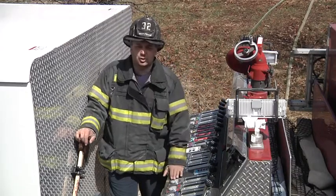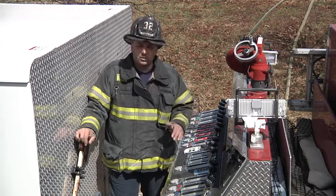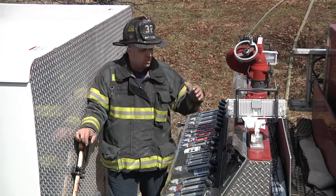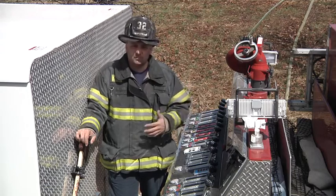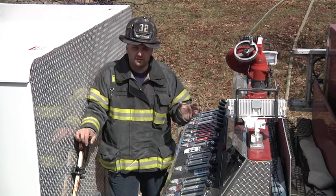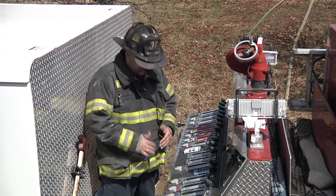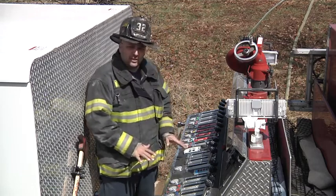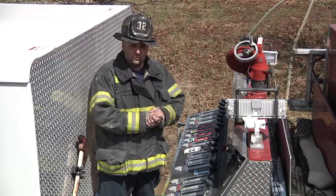We just went over looking at our gauges and determining whether that water made the nozzle or not. What you have to keep in the back of your mind is your fire hose could have been tested an hour ago — whether you tested it or outsourced testing, it doesn't really matter. That hose can still break 20 minutes, two days, three days, a month after it's been hose tested. Just because that hose has been tested doesn't mean that it's perfect. This break could happen at any given time. What we're trying to get from this information today is: if you're a chauffeur, pump operator, whatever you call it at home, you want to make sure that you understand the intricacies of your pump gauges and how it's going to work when we're inside of a fire and guys are calling for water. I'm Joe Alvarez. Thank you for watching Fire Engineering's Training Minutes.